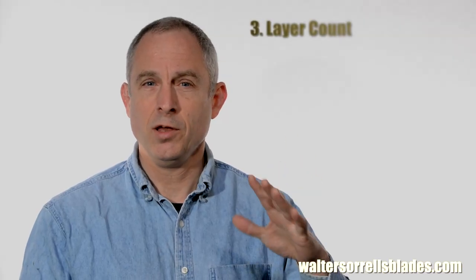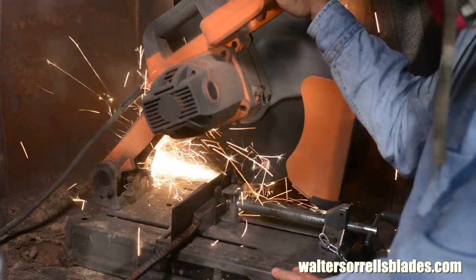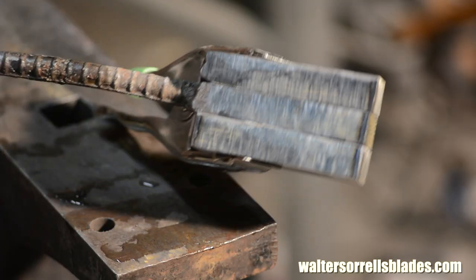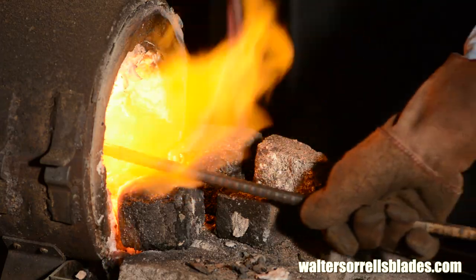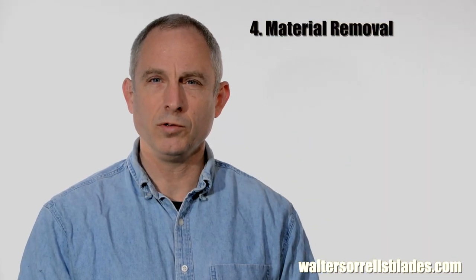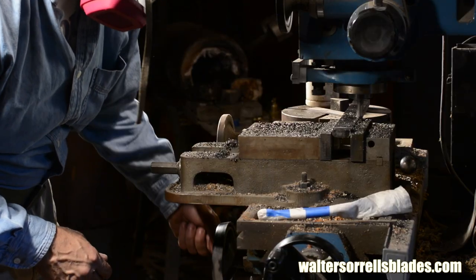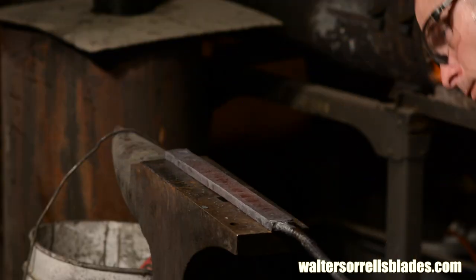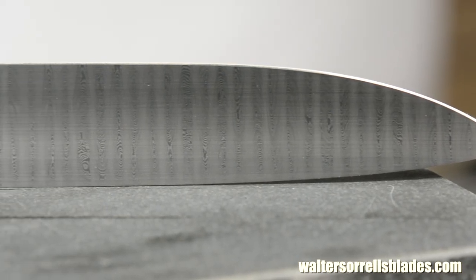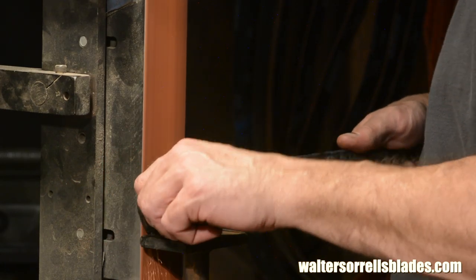Third element: layer count. The more steel layers you form, the finer your final pattern. The patterns we'll show in this video involve repeated forge welding, cutting, re-stacking, and re-welding. We'll show some versions with low layer counts and some with high. Depending on what you intend to do or what look you're after, you may want to start with as high a layer count as possible or not. Element 4: material removal. By removing material from an already welded billet — by drilling, filing, grinding, sawing, or milling — and then forging that billet flat again, layers of steel that were once in the middle of the bar will migrate to other positions. This is seen in ladder pattern, raindrop pattern, and others, but can also happen somewhat inadvertently as a result of forging, drawing, and removal of excess weld material.